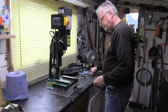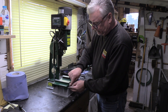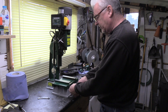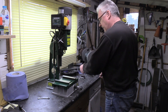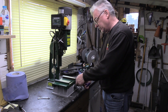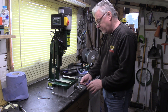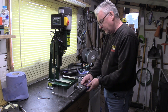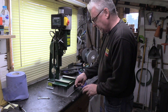Much the same as what we did on the other one, we'll take these screws out - it's the same sort of principle. It's got three screws, and the centre one has got the same sort of location as your side one. So these two are just pushing up onto the strip, and the centre one is in the location hole on the actual jib strip itself. I'll just move those out of the way.